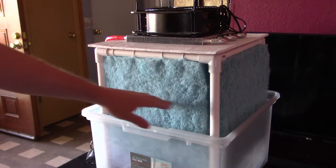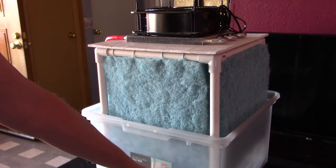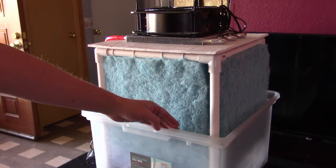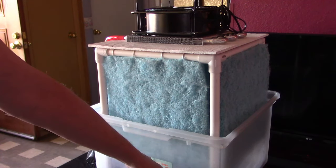The side effect of this, though, is that the evaporative process works on the pad. So as the water goes around and around the pad, it actually super cools the water in the bottom. That's because most of the water doesn't actually evaporate with each pass, maybe just 1%. Then all we're doing is taking advantage of the cold water in the bottom with an extra set of tubes and a pump